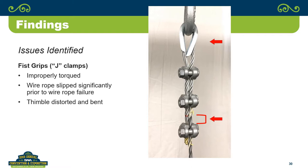Well, they'll go to a certain point and the fist grip will hit itself. It's like clamps. If you take your experienced EMD guys and test them on putting right angle clamps on and check the torque, I've found in testing that if they're using a Craftsman 11/16 wrench, they're generally between 28 and 34, because you go back and forth and there's a feel. But they're never to the actual spec. How many people actually have torque wrenches? I'm glad to hear that you've got this torque extension. I think that's a great thing. Every mechanic ought to have one of those in their toolbox to make sure they're getting the proper torque.